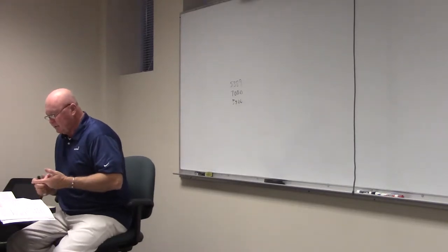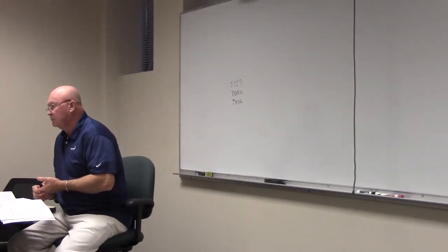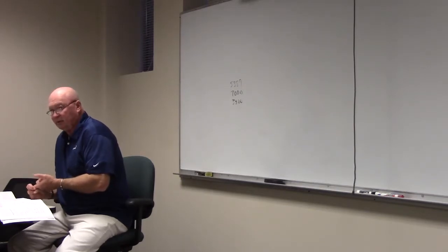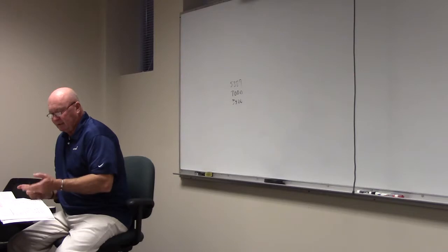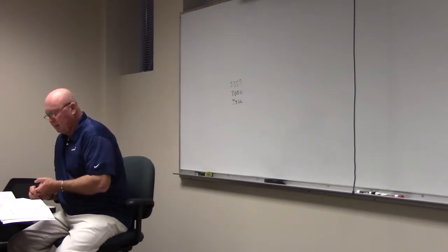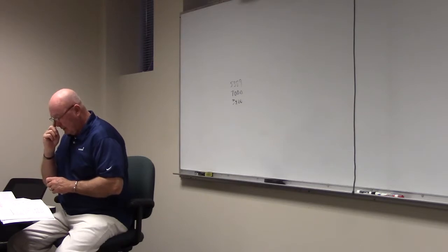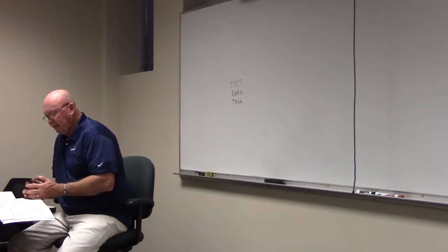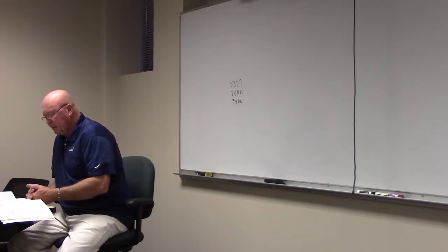Calculate the fixed appliances. So we got a dishwasher, says it's 1,000. The next one is a 3/4 disposal. If we look that up, that's 13.8 amps times 120 volts, 1656. Matter of fact, it's the same size as the one we had on the other example. The furnace blower is a third horsepower. That's 7.2 amps times 120 volts, that's 864. And the attic fan, which it says is a half horsepower, that's 9.8 amps. So we got a total of fixed appliances of 4,696.